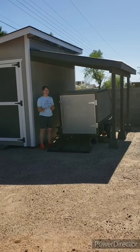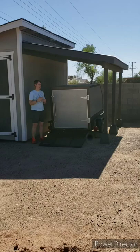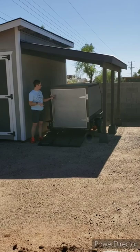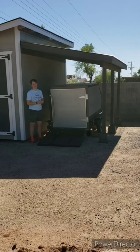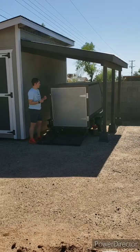So first of all, poor man's fiberglass is basically canvas glued on, so a canvas drop cloth, and then paint. You start with a diluted, like 50-50 paint and water mix, then you build up and eventually get a couple of good coats of an exterior paint. If you sand it in between, you get a really nice, smooth finish. And it's very hardy. A lot of planes and boats were made this way historically, and there's wood underneath poor man's fiberglass from decades and decades ago that's in really good shape. So anyway, let's see if we can try to get a little bit of a close-up of this.